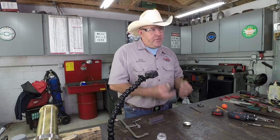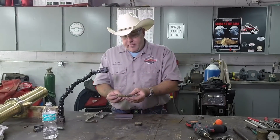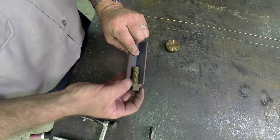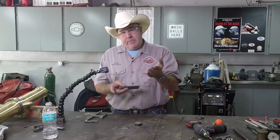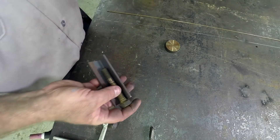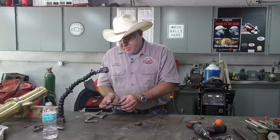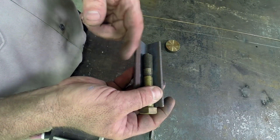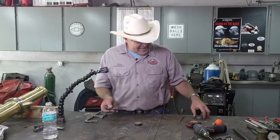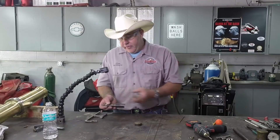This isn't my number one choice, but this is fall back and punt, so here's what we're going to do. I took another brass bolt just like it and cut the head off. I'm going to silicon bronze these two together — I'll set them inside a piece of angle iron to keep the two pieces straight on two planes, so we have a straight shaft, although it'll probably have a little wobble in the thousandths range. I also need to align the thread pitches so one thread start lines up with the other. After silicon bronzing I'll turn it to diameter on the lathe, then carefully thread over the silicon bronze with the correct die and hopefully make one bolt.